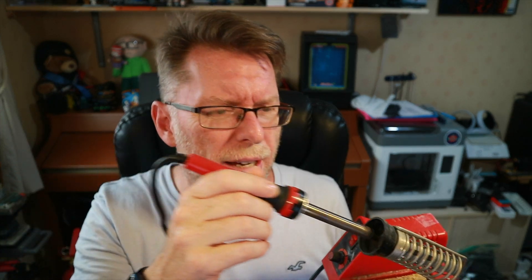Hello, let's talk soldering irons. A quick reminisce if you will. I started out with a big old thing like this which was mains controlled, took about 10-15 minutes to heat up, had this dial that said it was a temperature control but it didn't really work very well. Tips are interchangeable but this one kept falling out. Then along came the TS100, very much the iron du jour for a while, especially for FPVers — very portable, heats up very very quickly.